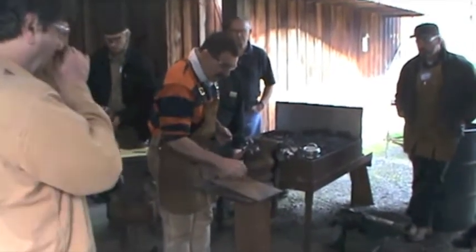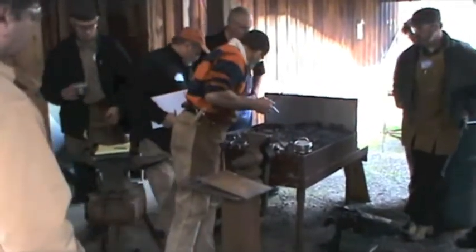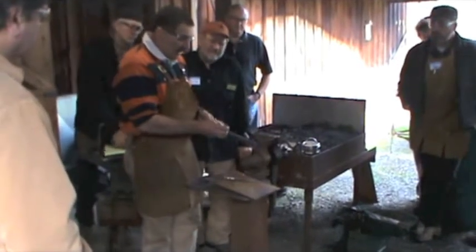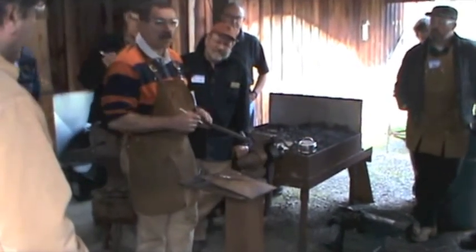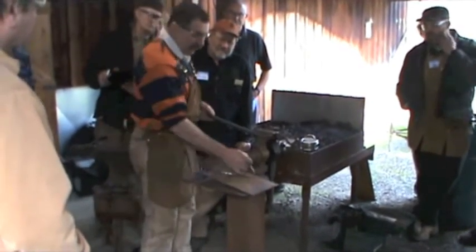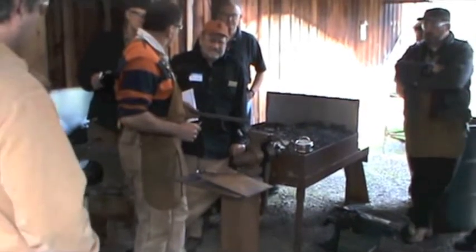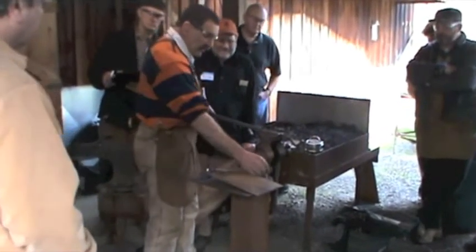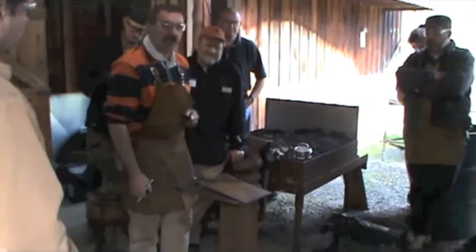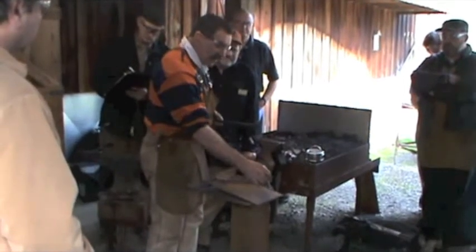So that's 10 inches from the neutral axis to here. I have three-quarters by half. I'd like to come up here, put a center punch mark in and make this corner — but how far back from the end? The information is in here: 10 inches. Not quite 10 inches because that's tapered. It tapers from half inch here down to — I'm going to call it five-sixteenths, because it's about quarter inch up here. Let's call it five-sixteenths. So it goes from half inch down to five-sixteenths over 10 inches.